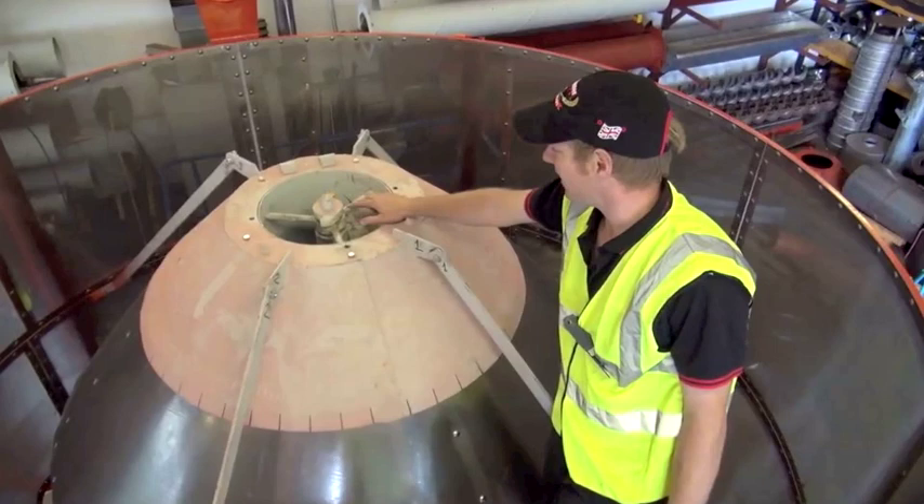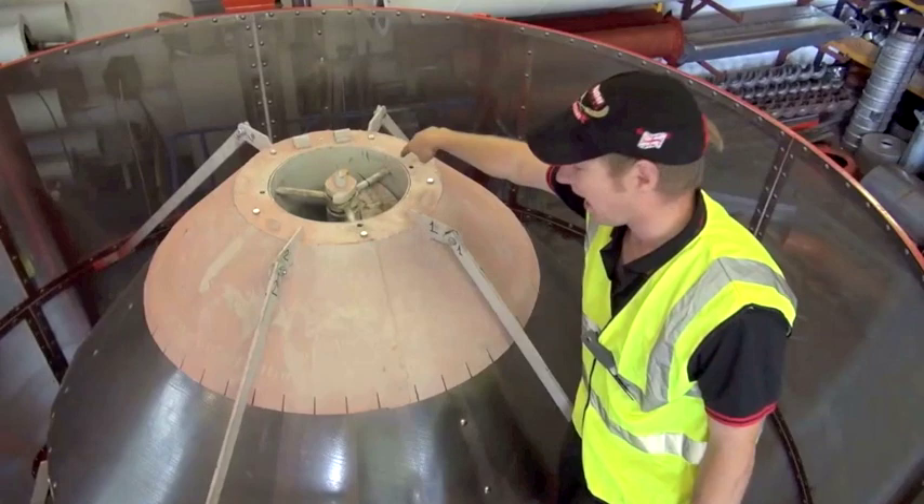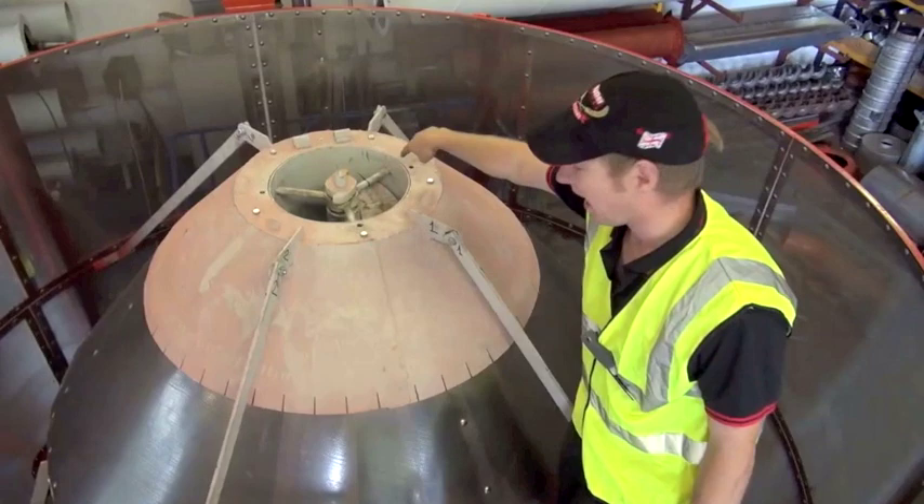On the electrically driven machines you have a double drive dog, so you just have to check the orientation of your top auger before you winch it up with your cable, to make sure that you haven't got a gap in your centre auger — otherwise this can stall the centre auger.